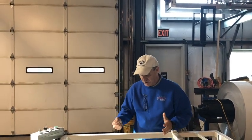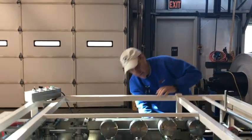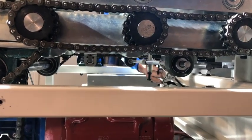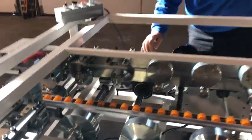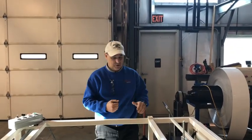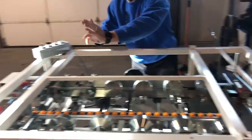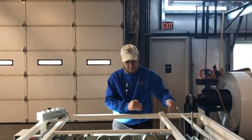Whenever you move that you need to do two things. It has on the bottom here clamps that you can loosen and tighten — you just pull out and twist. There are two in the front and two in the back, and once you loosen those you can move that front and back. Always take a tape measure and make sure after you have set it that you have the same distance in the back as you do in the front, to ensure you have exactly parallel bars.